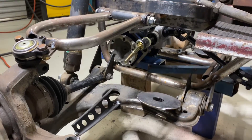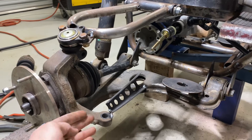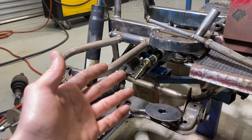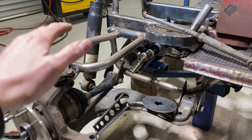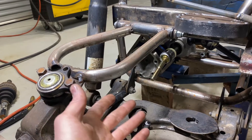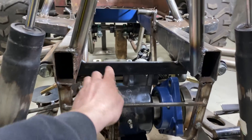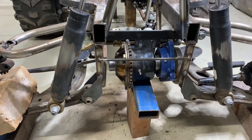This is how tight the front really is. I can't move the rack any further forward - if I extend the mounts this way we'll end up with truck-like steering, and anything out front is going to get smashed off because this thing is going to get abused. The engine can't go any higher either because I don't want to lift the center of gravity - I want to keep this thing lower to the ground.